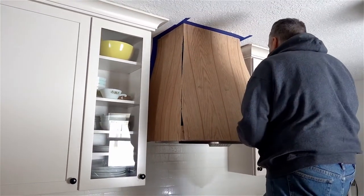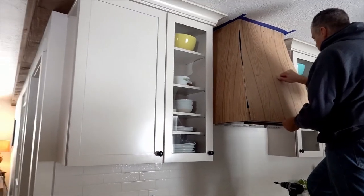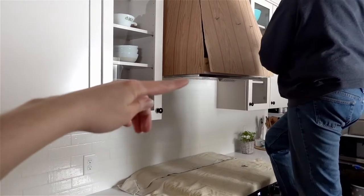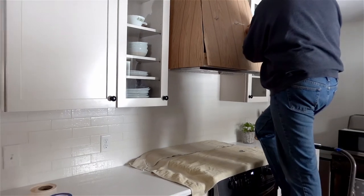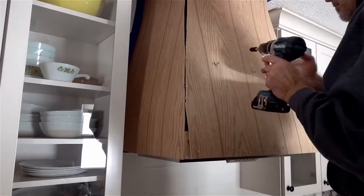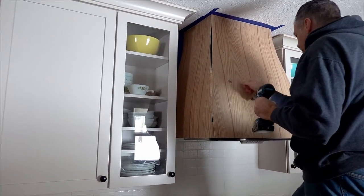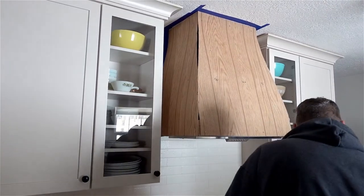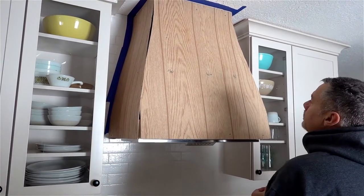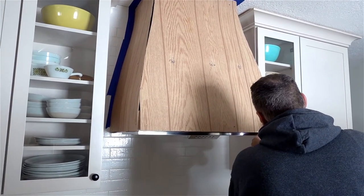It tapers down to 21 inches deep by 29 inches long, which gave them the look they're wanting. They have eight-foot ceilings in the kitchen, and the other measurement I wanted to mention was roughly 29 inches from the bottom two-by-four to counter height. We have a rustic piece of wood downstairs — an old barn wood slab — that we're going to be cutting and tapering to go around the bottom. So it'll look exactly like ours at home, with the plaster on top and the wood beam around the bottom.